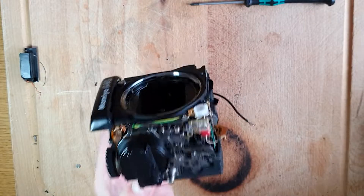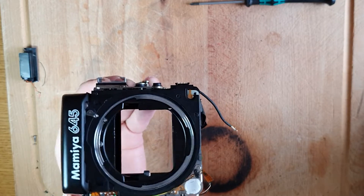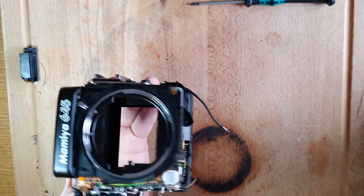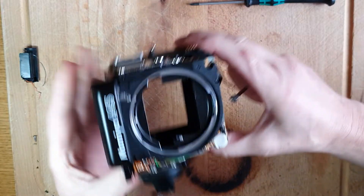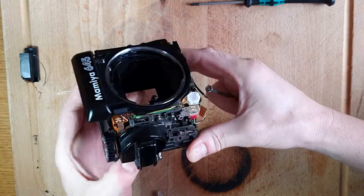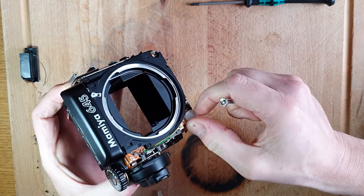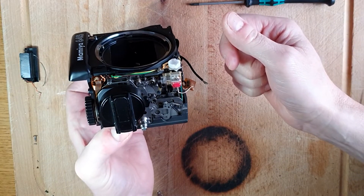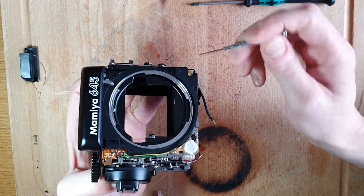For the sake of making this video as short as possible, I'm not going to show you how to take it apart because I've detailed that in another video on my channel, so you may want to check back on the previous videos. Anyway, so you have this situation: your shutter is open, your mirror is stuck up, you're pressing the shutter release button and nothing's happening — it won't wind on, it's completely stuck. The first thing we need to do is try to close the second shutter and bring the mirror back down.